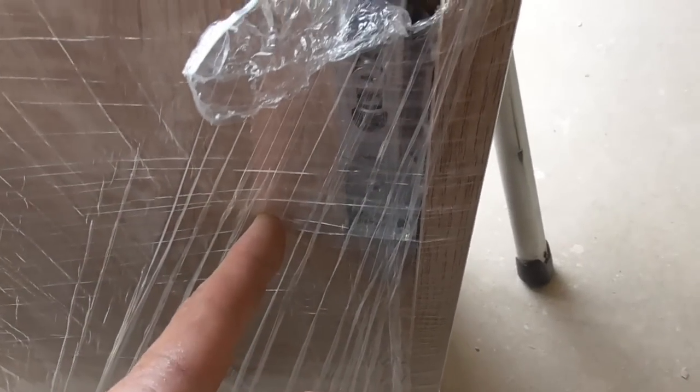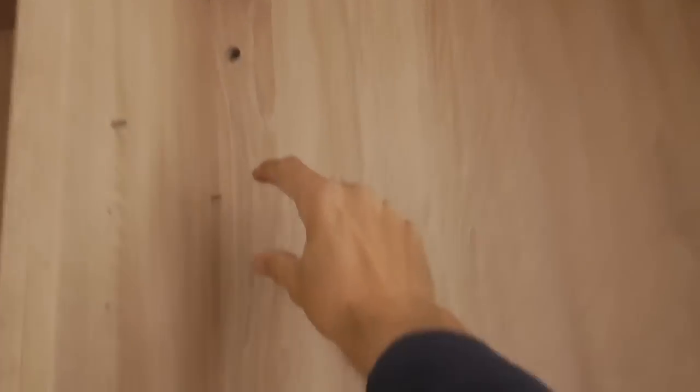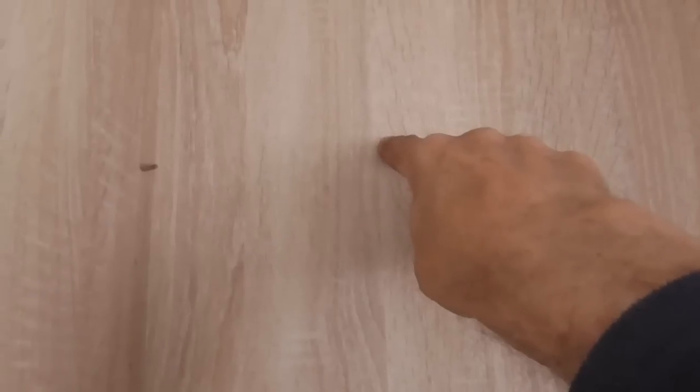And then what I could potentially do is, because I know where the studs are over here, if you imagine that 2x1 filler, packer, whatever you want to call it, would run across the back at about that level. Then wherever there's a stud, I could drill a hole in and put a hard fixing all the way through. Probably not ideal, but that's a bit of a hybrid system and definitely won't fall off the wall. So I don't know, I'll think about that a bit more. I trust my buddy about these, but the last thing I want is for that to fall off the wall, because my name will be dirt. But anyway, that's the next job we've got to do.